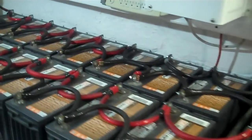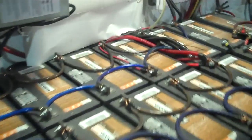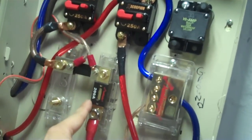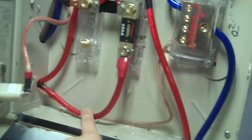I will get on the roof more — I've already put stuff up about the wind turbine. Basically what happens is: the wind turbine will feed down into this breaker. From this breaker it goes across the shunt and through a fuse — in case we have a surge of power or a problem. Then the wire goes up into the charge controller, or dump. If this meter gets to 13.8 volts, it will actually start dumping the batteries, because that means they're fully charged — they float charge, so they're typically full charge at about 12.8 volts, but ours will float up to 13.8, which is what they're rated for.